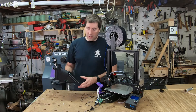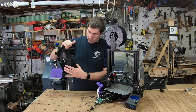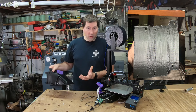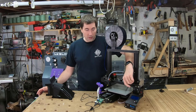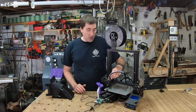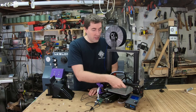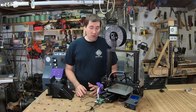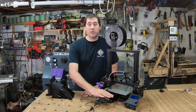One other problem I've had is that one of the axes started slipping at some point. What should have been a nice straight line got shifted over as it was printing — it lost steps going in one direction and kept shifting over as it printed upward. This was just a prototype so it didn't really matter, but it's obviously going to cause problems. I suspect something had gotten gummed up on the exposed rails — these little rollers ride on top of them, and if there's a chip, dirt, or gunk on there, it couldn't roll over it and got stuck. There does seem to be plastic in the air that deposits on the rails over time. I cleaned everything really well and haven't had any problems since. I'd suggest making sure the rails stay clean as you print.